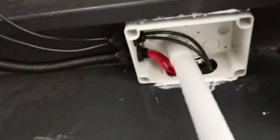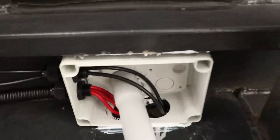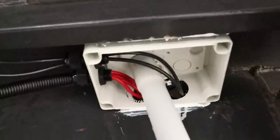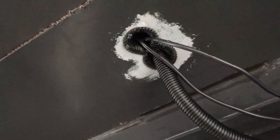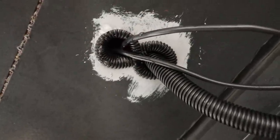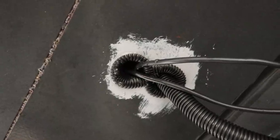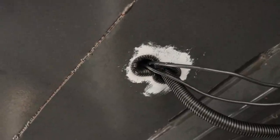So we ended up with our box basically working out all right, pretty stoked with that. And we've got our adjustable clamping mount here. This is just a piece of PVC pipe that we've just got jimmied in there to hold it at the second. And then we threw this conduit. So we've got the four red cores coming through. We've got the black flex conduit, goes up through our homemade grommets and into that box up top. There's no joins in the box at all. There is some water apparently, but there's no joins in that box at all. And then from there it goes through cable glands and out to each panel.